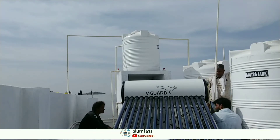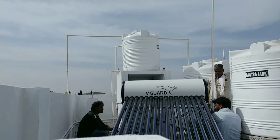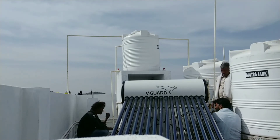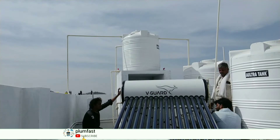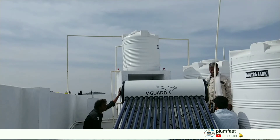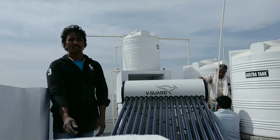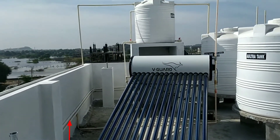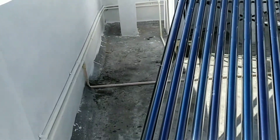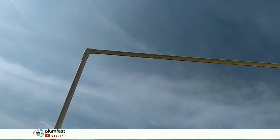Number 2, there is a tank — here we have a 200-litre capacity. The tank is at height. Here we have 200 litres. Then we need to get the pipe and connection. We need to get the line and a hot water point in the bathroom. Then we need to set the tank height and solar heater, fill the tank, and get the outlet here.